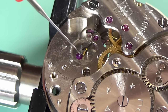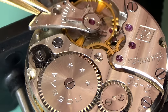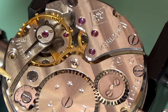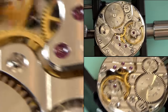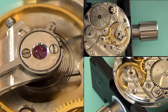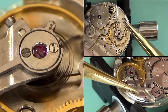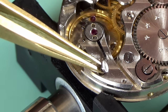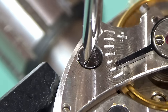A little bit of wind went into the watch and I'm going to check that the pallet fork snaps cleanly backwards and forwards. When it does, I can go ahead and fit the balance. There's no auto-start here - this should start up immediately when I put it in. A little burst of air sets it right to running. This seems to indicate I've got all the parts back in the right place - I am overjoyed to see this tick. My friend didn't lose any parts, which is another minor miracle.